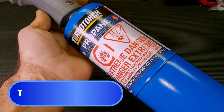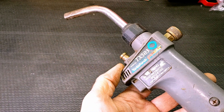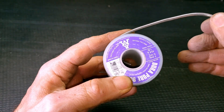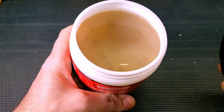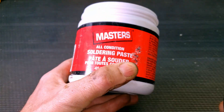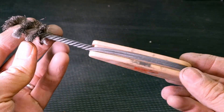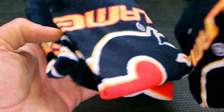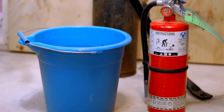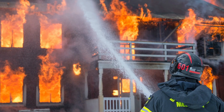Presuming you already know how to solder, you're going to need the following equipment. A gas soldering torch kit — propane or MAP gas will suffice. This kit should include at least the following: solder that does not contain lead, very important for health reasons and usually mandated by plumbing code; acid paste or flux with applicator brush for allowing the solder to stick to the copper surfaces; abrasives for cleaning the copper materials such as a wire brush and grit cloth; and a handful of clean rags for wiping your joints clean after soldering. Be sure to also have a fire extinguisher or full bucket of water within arm's reach just to stay safe in case your soldering venture doesn't go exactly to plan.